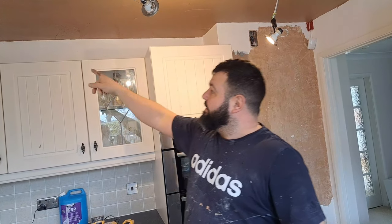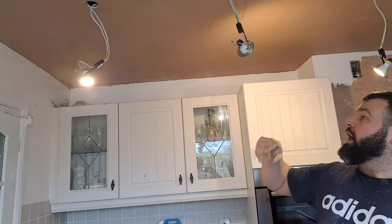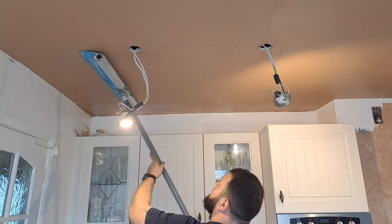it's gone right off. That up there will have gone right off, and then we'll second coat it and we'll build that a little bit more, then hit it with the Darby again. Build it a bit at the start, go right around the whole ceiling, put a little bit extra on the second coat, and we should be somewhere very close to that.